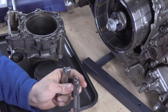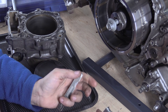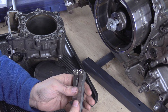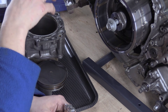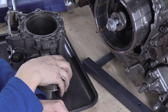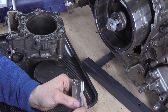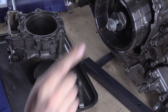I've seen people start stacking two or three feeler gauges on top of each other — you don't need to be that accurate for valve clearances. In the next video we'll literally measure piston ring clearances, piston clearances, pins, pistons, bores and so on. I'm done — I hope that makes sense. I'll see you in a bit.